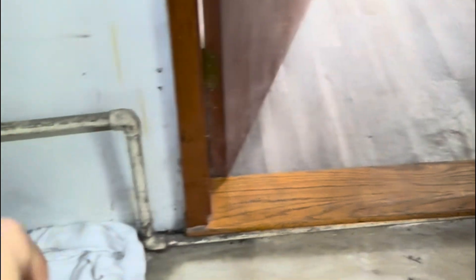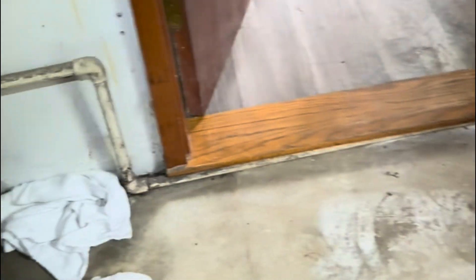So when they installed this drain line, they didn't want it to be in the way of the door. So they installed basically what's essentially a four-foot-long P-trap. That is what is fully clogged up with dirt, debris, rust — anything that comes off that coil down that drain line.